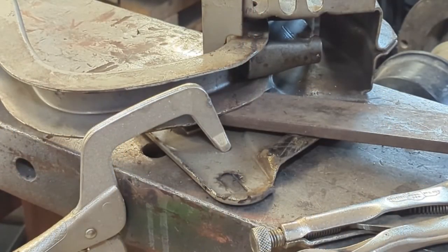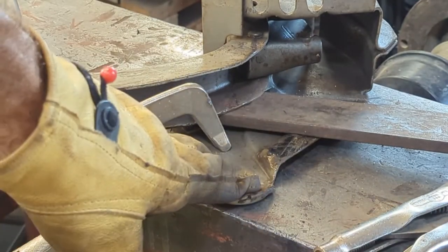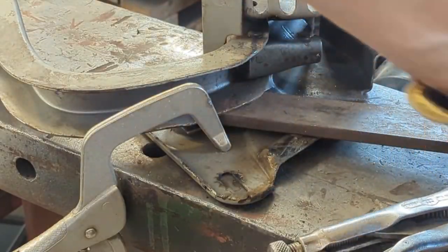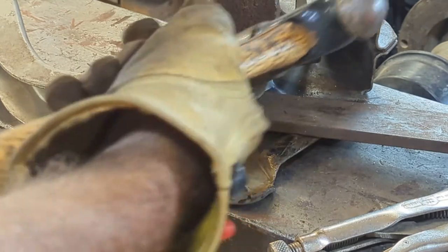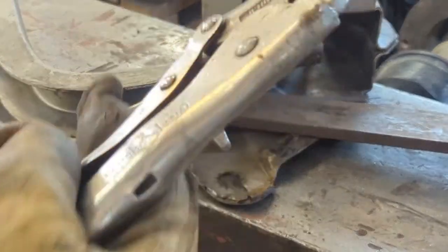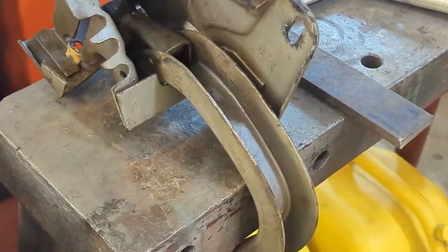After the porta-power, I put it on my heavy metal bench, clamped it down, and put a piece of flat bar under one side — the opposite side — then used a ball peen hammer and a piece of steel to try to straighten out this upper lip right here. I know it might be hard to see because the light's coming in from the front door. Then I used vice grips to manipulate it to look a little better. I got it as straight as I needed.